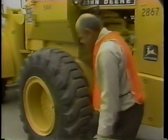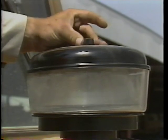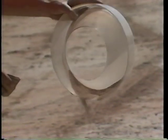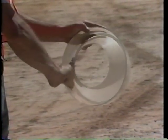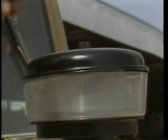As part of the pre-start check, you need to inspect the engine's air filter system. Your loader may be equipped with a pre-cleaner. If dust or other material has accumulated in the bowl, clean it. Dump out the dirt and wipe the bowl with a clean rag. Be careful if the pre-cleaner is plastic — it can crack or break if you hit it against a hard surface. Daily cleaning of the pre-cleaner will greatly reduce clogging of the air filter elements.